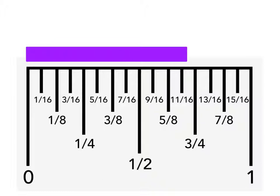Realistically, most of the time when you measure an object it's not going to line up perfectly with your ruler. With this purple rectangle, the end doesn't match up perfectly with one of the lines, so you have to decide how accurate you need your measurement to be. To the nearest sixteenth it's closest to eleven-sixteenths because it's closer to that line than to twelve-sixteenths. To the nearest eighth — counting every two markings — it looks like it's closer to six-eighths. And to the nearest fourth of an inch, it is clearly closer to three-fourths than it is to two-fourths.